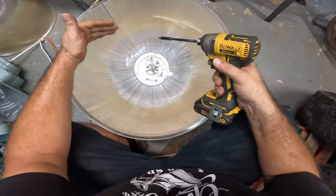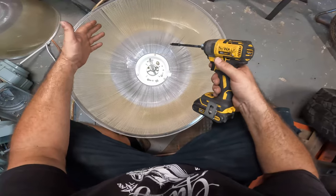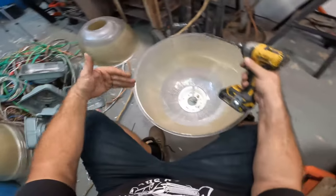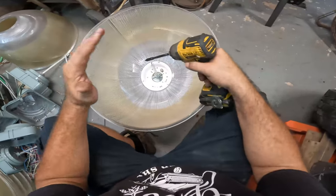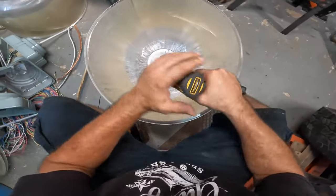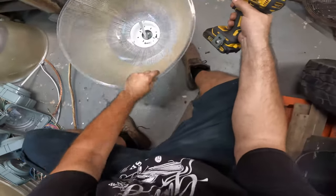If you do that when you've got rusty, corroded or old looking screws, or they're just giving you problems and you keep stripping the same screw over and over, give it a tap while you're doing that, rather than bearing down on it super hard if you can't get in that position.